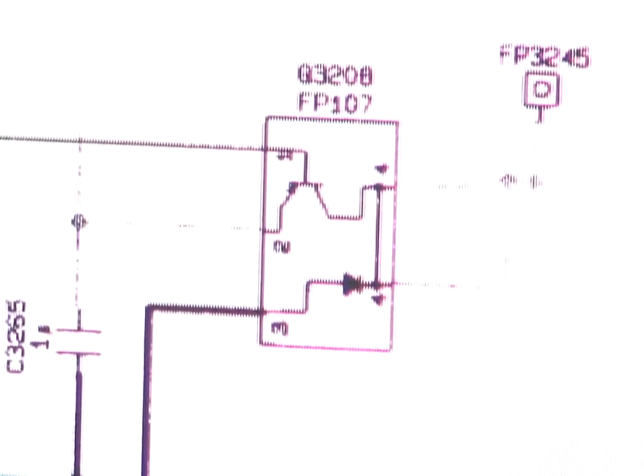I can't quite ascertain what these Schottky diodes are for in these circuits. It's connected from the output with the cathode on the output and the anode on ground. I'm really at a loss as to what it's used for — I think it could be some sort of short circuit protection or reverse voltage protection, but it doesn't seem that obvious, at least not to me. So for the time being I'll leave the Schottky diode out of the circuit and just make do with the bodge transistor.